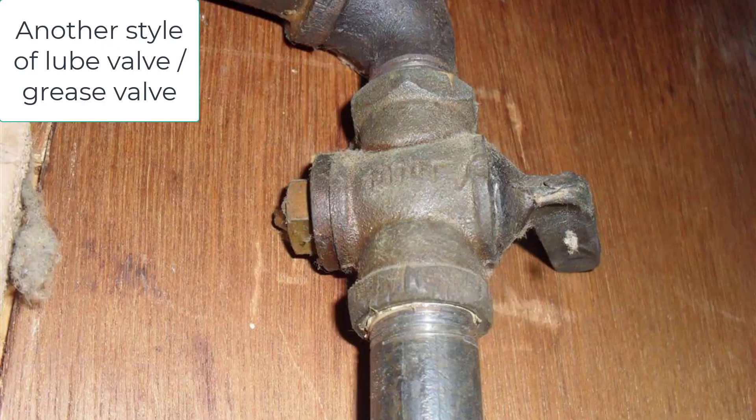For that reason, anytime we come across these on a home inspection, we say this is an old type of valve — it'd be a good idea to replace that valve whenever you replace the appliance it goes to. Nobody wants gas valves on their house that need to be regularly maintained. It is kind of a pain to maintain them: you need to have somebody turn off all the gas to the house, take the valve apart, grease it up, put it back together, turn the gas back on, and then relight your pilot lights. They are much more maintenance heavy. We only find these at fairly old houses.